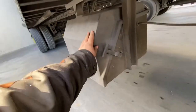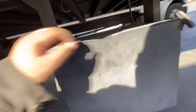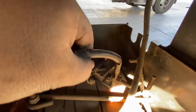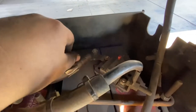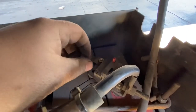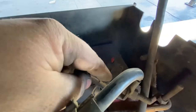There are different varieties and locations — different makes — but they're all going to be pretty much the same. They're going to have a set of batteries. This cable comes from your charge cable for charging the batteries, and there's a breaker in the battery box too for the charge cable. If it looks disconnected like that, it popped. A lot of times there can be a surge and your motor's not working. You have two breakers: one in the tractor for the charge cord to the batteries, and one that goes from the batteries to the motor. Push it back in — it should reset and you should get power to the pump.